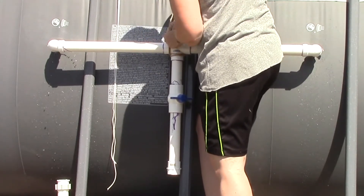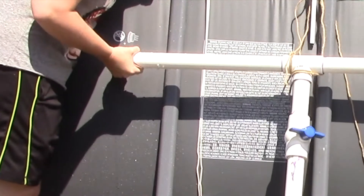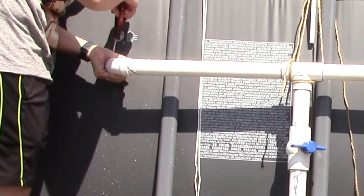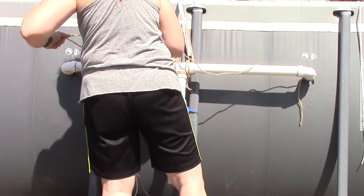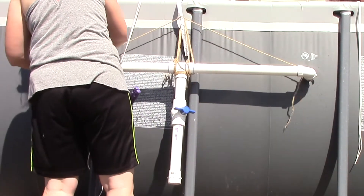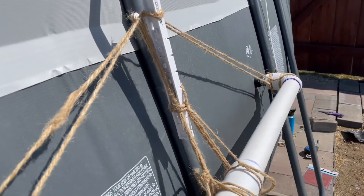You can see I pushed a little too hard and started leaking water on the left — I'll address that. I grabbed that suction filter, removed the plug, and pushed that PVC pipe all the way through. It's at three and a quarter inches, and now I'm working that suction filter over that three and a quarter inches so it goes through that black nozzle. Now I'm going to tighten that pipe clamp around that suction filter again, and that should keep the water from going out. I get back to work supporting the PVC pipes — I really want to keep that weight off those black tubes that come out of the pool.